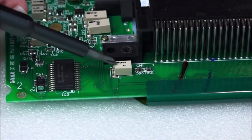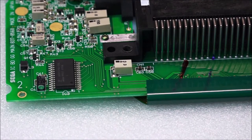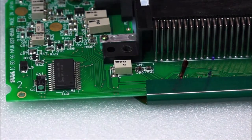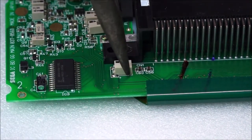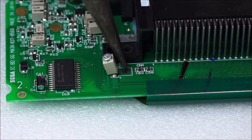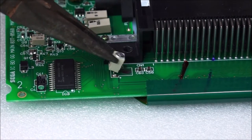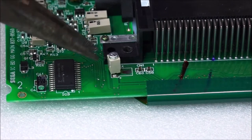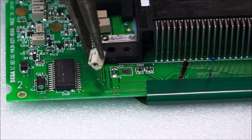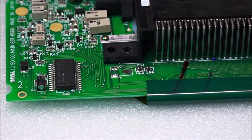Okay. So yeah, we're going to start with removing this one. What you want to do first is go ahead and grab your long nose pliers, these things, and you're just going to want to get it firmly at the edges and bring it up, okay? You can just see some of the glue underneath there. I'm just going to rock it forwards and backwards until the legs ping off. I'm not trying to grip this too hard either. There we go. That snapped off very nicely. Hope you can see that. Great, I'm just basically going to put this to one side. We'll never use that again.